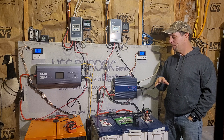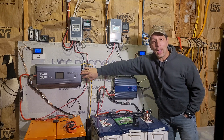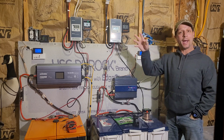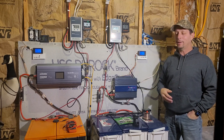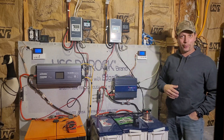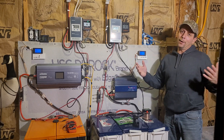That gets you a small system — if you buy one single panel, that gets you a 200-watt panel, 200 amp hour, 2,000-watt system. And that will be fun to play with. I was happy with something along those lines to run my outside lights and charge my batteries here in the shop. If you've got a small trailer, you might want to put all that together and use it inside your trailer — you can charge your batteries, and in a pinch with this inverter you can run your power saw and quite a few other things. That's a possible use for a small $1,200 system.